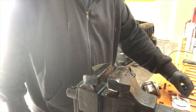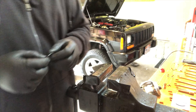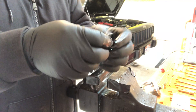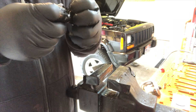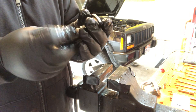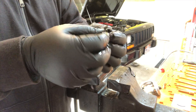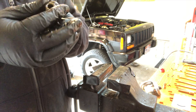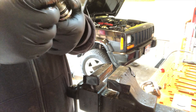I've got a couple of seals — I've got the larger of the two, which is going to go on this part right here. Take your favorite oil and just get a little bit on your finger and work it into the seal to lubricate it. Try not to roll it as you put it in — just kind of work it over. There we go. Now I still have some oil on my fingers so I'll go ahead and lubricate the smaller seal. This is the one I want to be careful of — when the other seal came out it went over the threads and didn't really like it. Keep it working gently, don't stretch it, keep it kind of even the whole way. And it just popped right in.